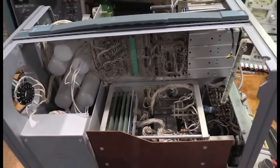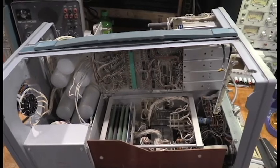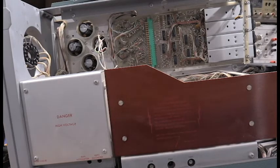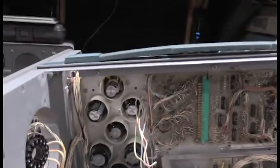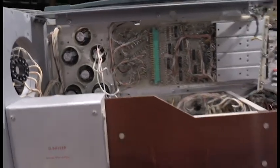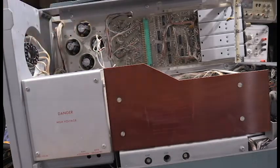Repair is progressing. I did not expect this to be this extensive of a rebuild, but you never know when you get into it. Nothing we can't handle, but longer than I expected because I am going to have to order some of these parts. Let me get the capacitor numbers and then I'll put in a DigiKey order. Through the magic of the camera, I'll have to wait — you guys won't. Here's the other side of the unit with all the capacitors put back in. The tube's still out. These are the caps that I had to replace. I'll show a quick shot of where I was at without the tube in. Next step is to put in the enclosure which has the tube clamp, then get the enclosure and the tube back in.